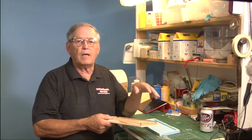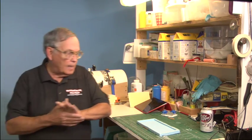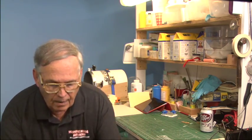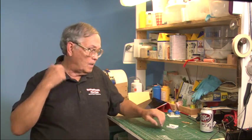It looks like silicone would never run out, but trust me — I've got some on the floor over here where it ran out of the larger mold box. Luckily it leaked just a little and then the leak plugged itself, but if that leak had been higher, it wouldn't have stopped. This stuff gets out and just goes everywhere. There are two things to worry about in the cast process: how long do I have to mix it, and how long before it sets? As soon as I start mixing, I can feel the heat it's generating — heat is what sets the urethanes off. You don't want to be mixing very long before getting it into the mold or it will start to get thick and you won't be able to pick up your details.